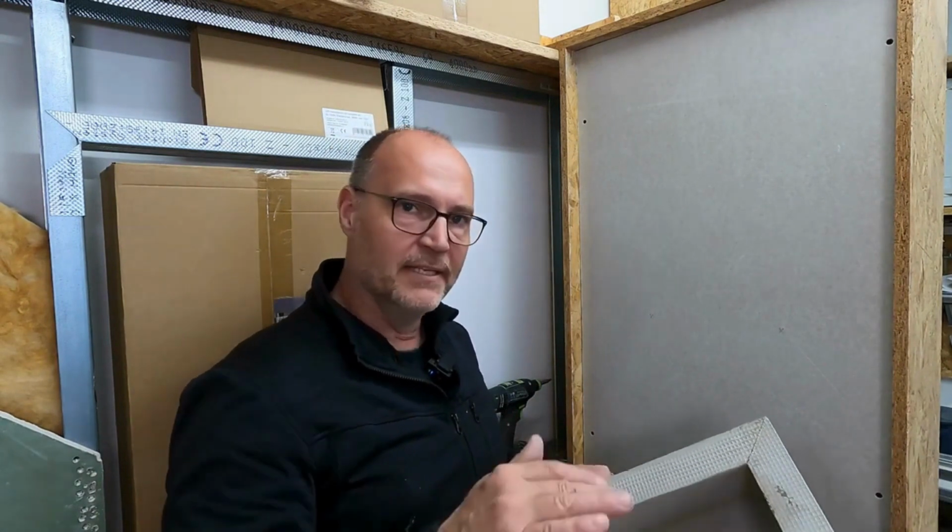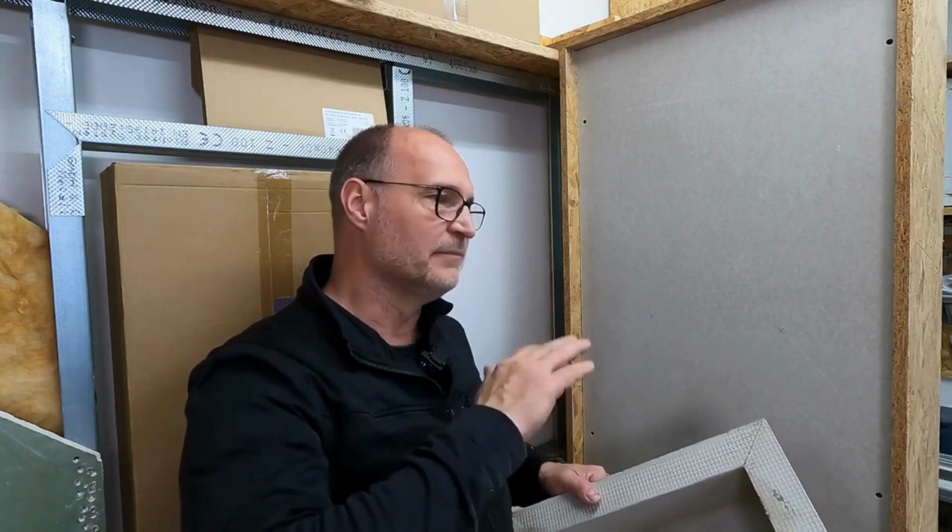The tiler usually determines the heights before he starts tiling. If I have a walk-in shower, then I have to measure everything differently than if I had a shower tray here. Then of course he has to go a bit further down into the floor. That's why I can't really determine the position of the niche. It's important that the owner coordinates this with the tiler.